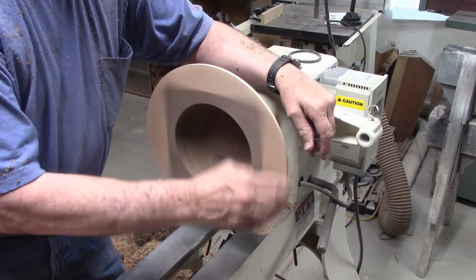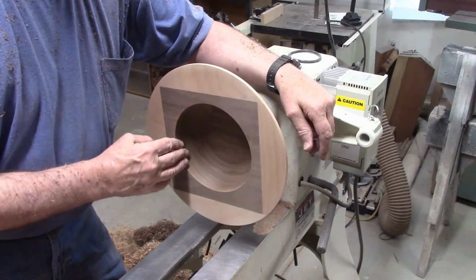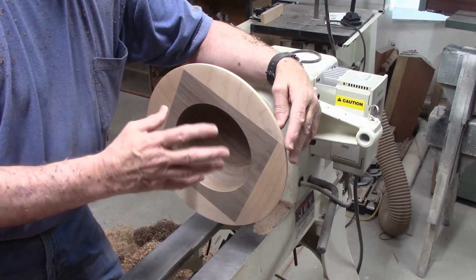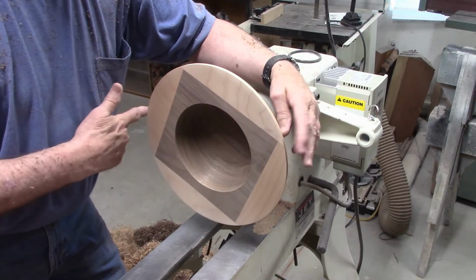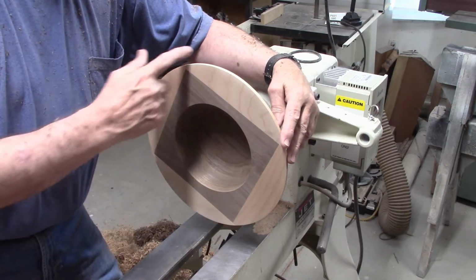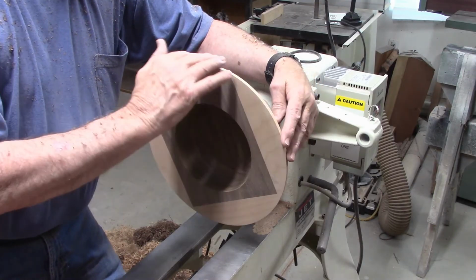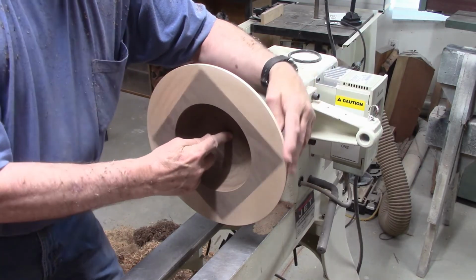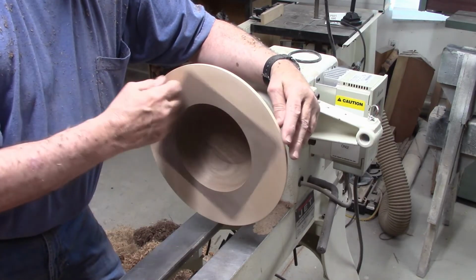The reason for that is the actual lineal speed that this thing is rotating. When it makes one revolution on the outside, it's going much faster than the portion in the center. For instance, this is about 12 inches. So you multiply that by pi and you come up with a little bit better than 3 feet. So every time this rotates, it's moved linearly 3 feet. Now, on the inside here, that's only about 1 inch in diameter. So this is only moving 3 inches in the same revolution.